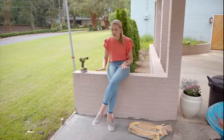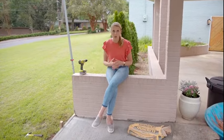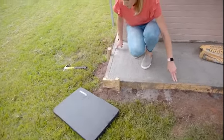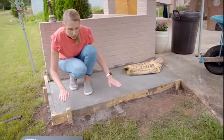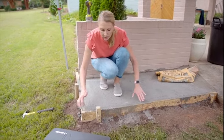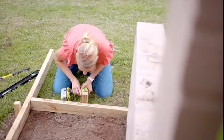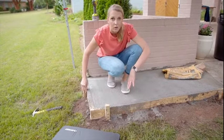You want to figure out where you want it level, then dig and remove some dirt if needed. You're going to use screws long enough to go through your two-by-four to make your form. Since I just had two sides to do, I used two two-by-fours and screws to attach them together. I used a level to make sure it was just a little bit off level so the water flows away from the wall and away from the house. Then attach them together and use wooden stakes — drive those into the ground on the outside of your form and attach with screws to hold the two-by-fours in position.